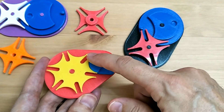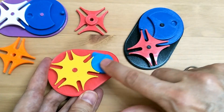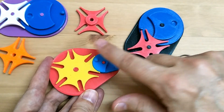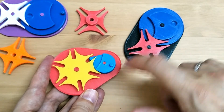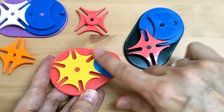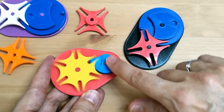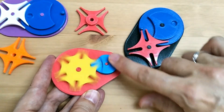Let's give it a try. Yes — and it's working! The little cam and pin are going into the slots and moving it just one-sixth of the way with each rotation. So again, for constant rotation on one side, we're getting intermittent but slower movement — it takes more revolutions of the input to complete the output. We had success! This was a lot of fun making this little mechanism, kind of a derivation of the first one, taking it one step up.